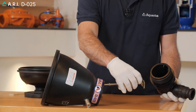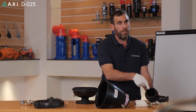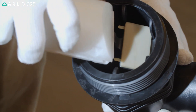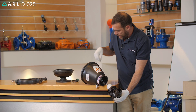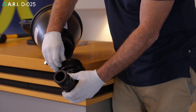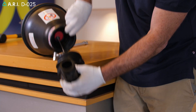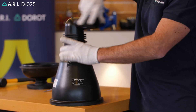Now we're going to reassemble the rolling seal unit to the top body. We're going to insert the top part of the rolling seal assembly to the inner groove on the body. We're going to slide the two sides of the float in its railing and close it down with the clamping stem. Once the unit is inserted, we're going to make sure that the o-ring is placed correctly in its groove and close the whole top assembly.